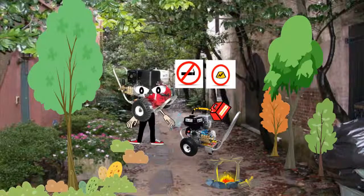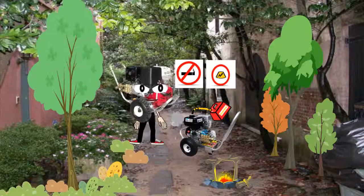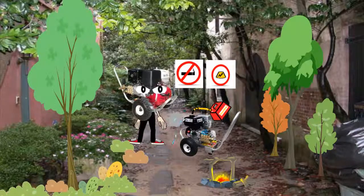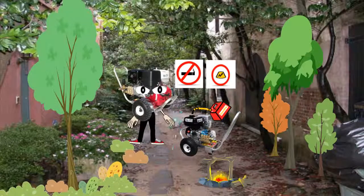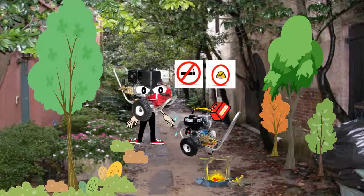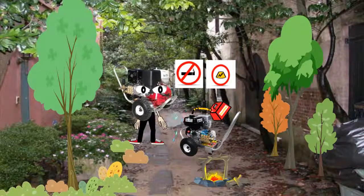Final recommendation. Take these additional precautions. Do not touch or come in contact with hot mufflers, cylinders, cooling fins or hot exhaust gases as this may result in severe burns. Never tamper with governor spring, governor links or other components which may increase the speed, RPMs, of the engine. Do not operate pressure cleaners in the presence of flammable vapors or gases.